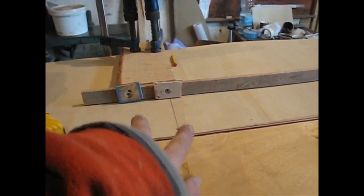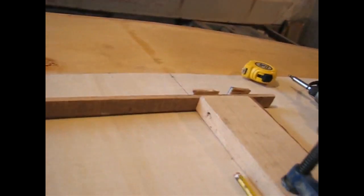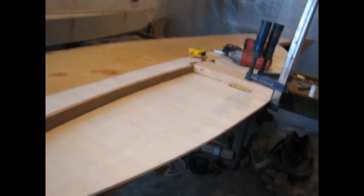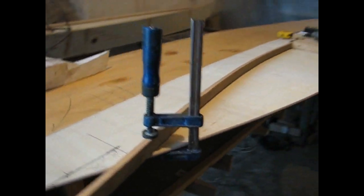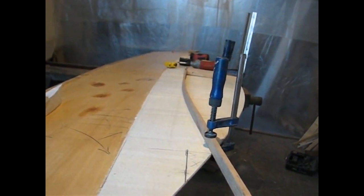I clamped on a piece of wood, then popped two screws into it — that's holding my batten. Now I'm running in a curve. I'll go under the boat. I like that curve. It lies in about nine centimeters over 90, which is 10 per meter. That looks like a good curve to me — I don't think it's going to dig in.